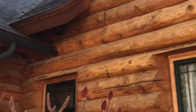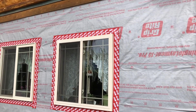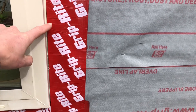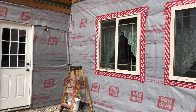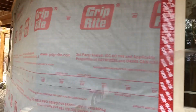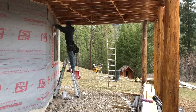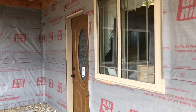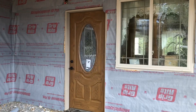Here's Paul, my renter down here. He's getting this underlayment put on — kind of like house wrap, it's a moisture vapor barrier — sealing around the windows. Then we're going to put siding on from up against the fascia down to within about six inches of the bottom. From there on down we're going to put diamond mesh and a scratch coat of concrete in preparation for rocks next year. He's going to hang the siding for me. We used to have a door right here and he took that out. We also replaced a French door with a regular three-foot man door. A sheet rocker guy came out to fix the inside.